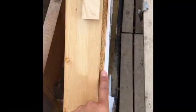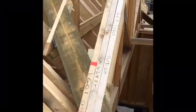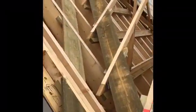Going up a level here — these are called cavity barriers. As we go up, they go around the window. The build-up is timber frame, 11mm OSB, and a breathable membrane on there. On this one we've got a couple of girders going through and then diminishing trusses up to the roof.